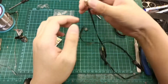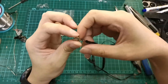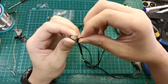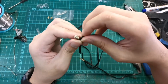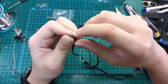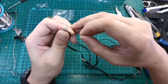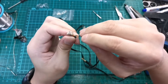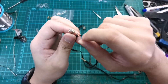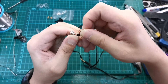Let's start off by taking a look at the driver. This is the dual driver unit — we have a tweeter and a bass driver. You can see small wires linking them up. From observation, the gold colored wires are the ground wires, the red is the signal for the woofer, and the green is the signal for the tweeter.